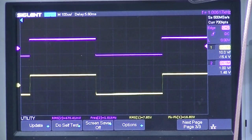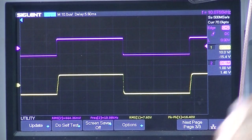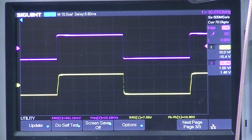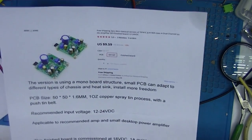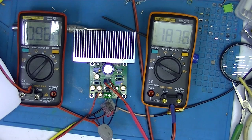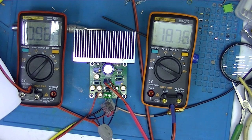Looking at 1000 Hz — that looks almost perfect. At 10 kilohertz that looks very, very good. Again, we're making 8 watts: the input voltage is almost 1 volt and the output increases to 8 volts, which is 8 watts. What did the seller claim? He didn't claim any wattage at all for 1969, but I'm not running it nearly at what Linsley Hood would have run it. But that makes a nice 8 watts.